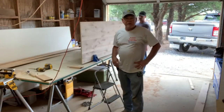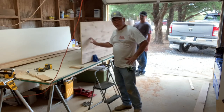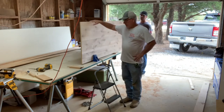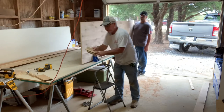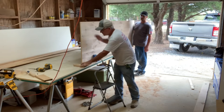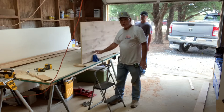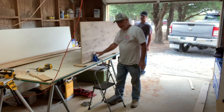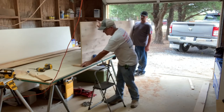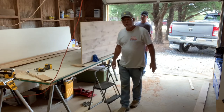This mantle is so wide that we're putting it all together with the Kreg pocket hole kit. Usually you're working with something that's just a couple of small pieces so it works great in that clamp, but right now this is so wide because the top of that mantle is that wide. So we've got to put it in this little Kreg jig. We built some spacers that hold this straight and we're just sliding down every 6 inches. Once we get all those done, we'll screw it into the one before.